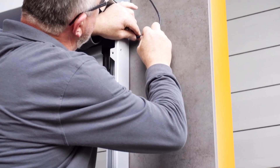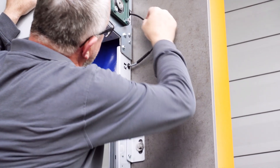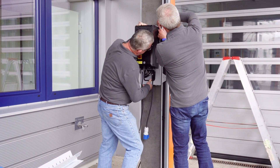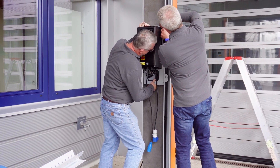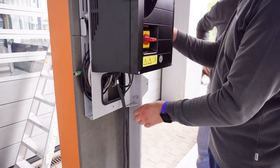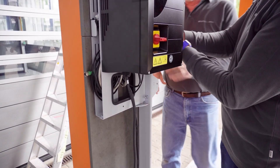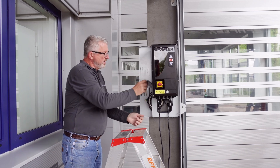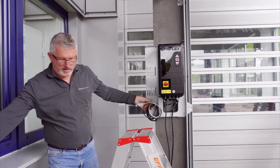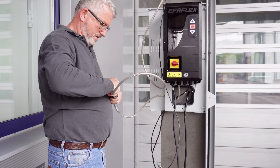The SRT Easy Fit is equipped with a TLG — a door line light grid — and stand. Here we see how the TLG cable is being connected. The control box is already pre-assembled on a bracket with a tray that only needs to be screwed to the frame on the motor side. Each cable has its own coded plug, which is connected to the pre-programmed door controller.